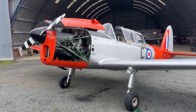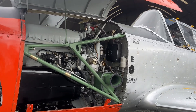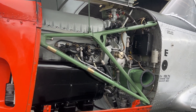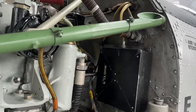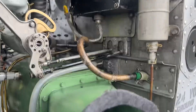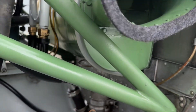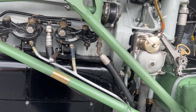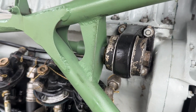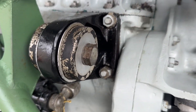Let's walk in a little bit closer. The engine is attached to the airframe by these green engine bearers, and they're pretty much held on by four bolts — you can see one bolt there, another bolt just in there, and two corresponding on the other side. They attach to the engine through these engine mounts, which have a rubber shock-absorbing block and bolt onto the crankcase.